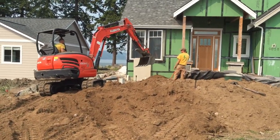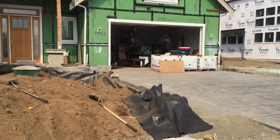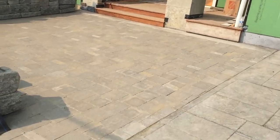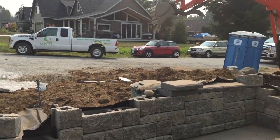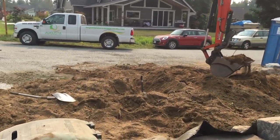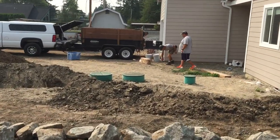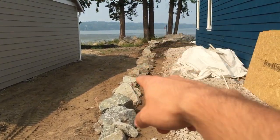Progress is being made here on this job. It's starting to get a lot of backfilling done. Unfortunately, some of the blocks from that main wall haven't come in yet, so we haven't been able to finish the wall, which is disappointing. But we'll be able to get at least some sort of a grade coming down here with all this fill dirt. You can see the pavers have been laid all in here with a random pattern — looks pretty good. We were waiting on some of these Barcelona-type blocks. We're using the excavator to pull all this fill dirt over so we can fill this cap and hide it. Then we'll start putting the boulders and the fountain up. Over on the south side of the property, we've installed the rocks all along the side here, which will serve as retaining. We'll backfill this all with soil as well.